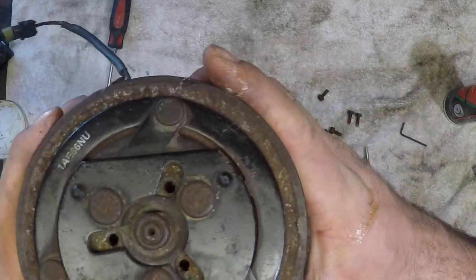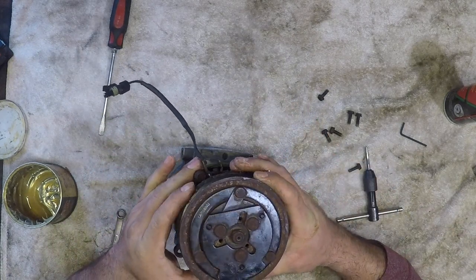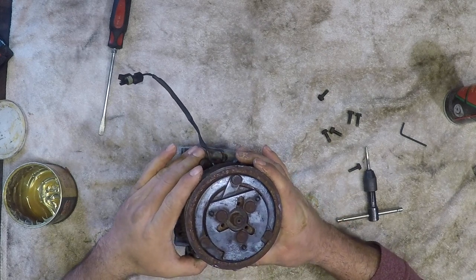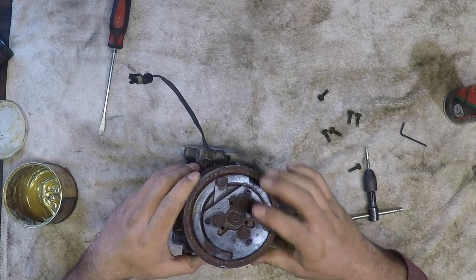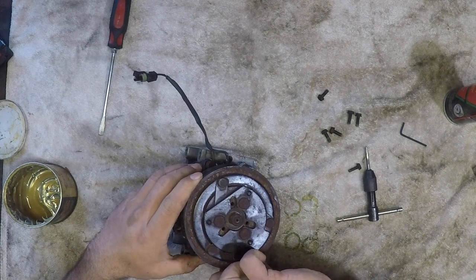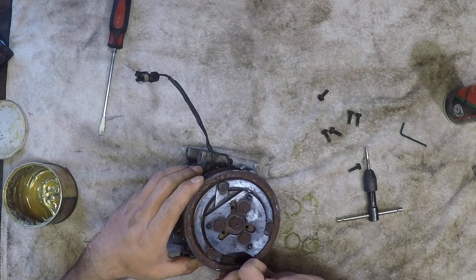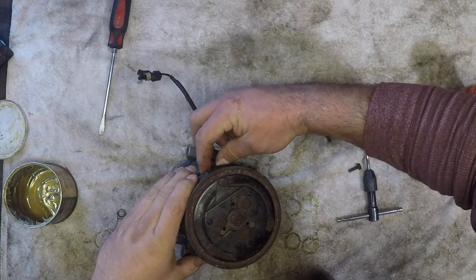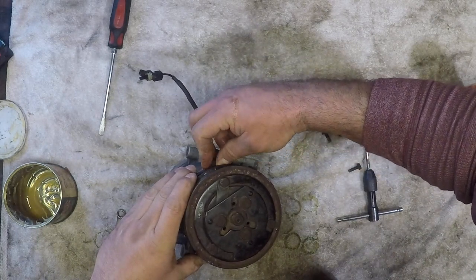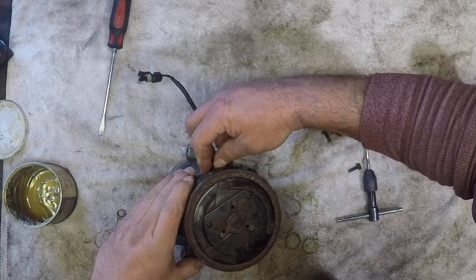Now the best idea is to hold it from the plate so the wobble plate can spin freely. Pay attention as you drop it down in there — try to line up the slants as you set it down on top. It's going to want to move around on you, so be careful. Hold it in place and don't knock that wear plate off. As long as you used a good amount of grease and don't knock it around, they usually stay in place. Don't use the bolts to pull it down — if you have to do that, something inside is wrong. It should go down pretty much finger-tight.